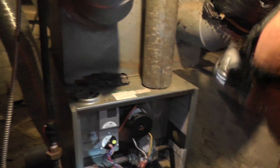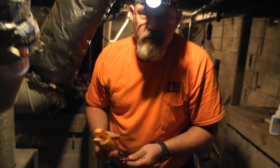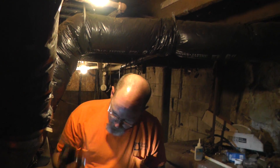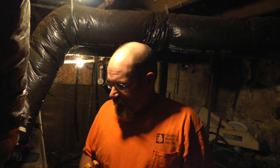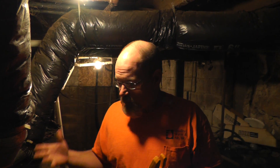So that's what the problem was — there was a bird stuck in the chimney. You'll find this a lot of times in the fall, on first fire-ups. It's had all summer — birds falling down in the chimney, making nests, all sorts of things like that. So if you ever have a pressure switch issue, the first place you want to look is to do exactly what we just did. Nine times out of ten it's a pretty simple fix. Thanks a lot for watching, and we'll see you all on the next video.